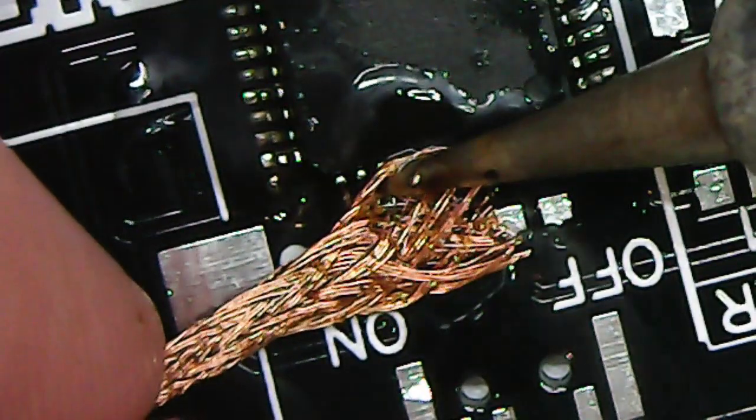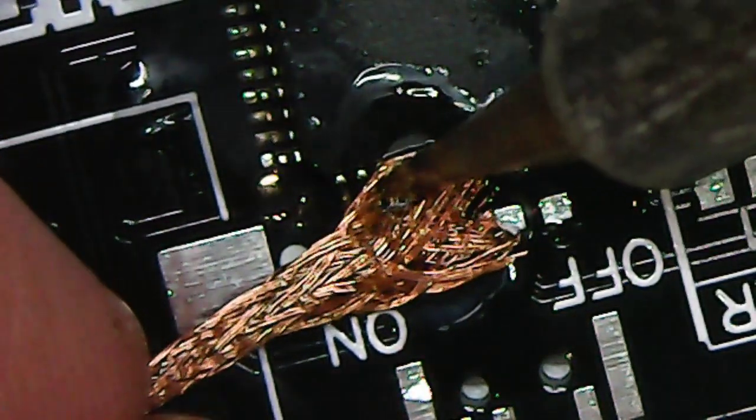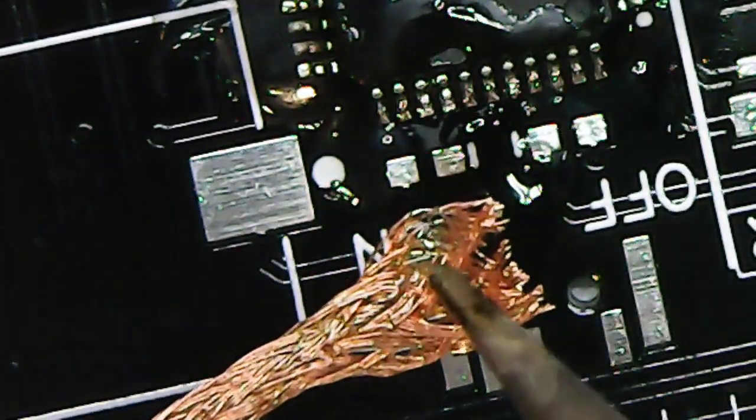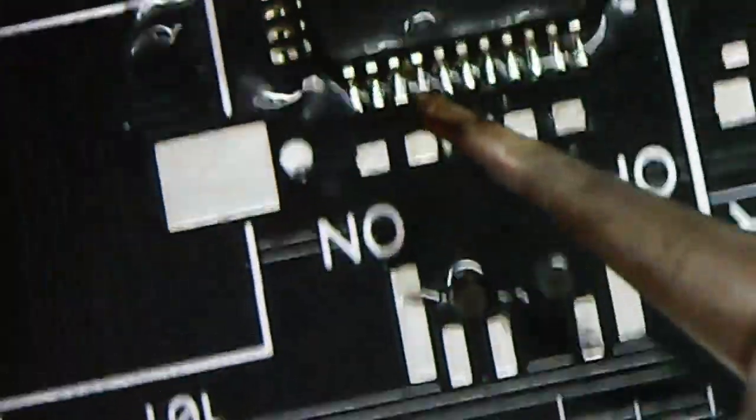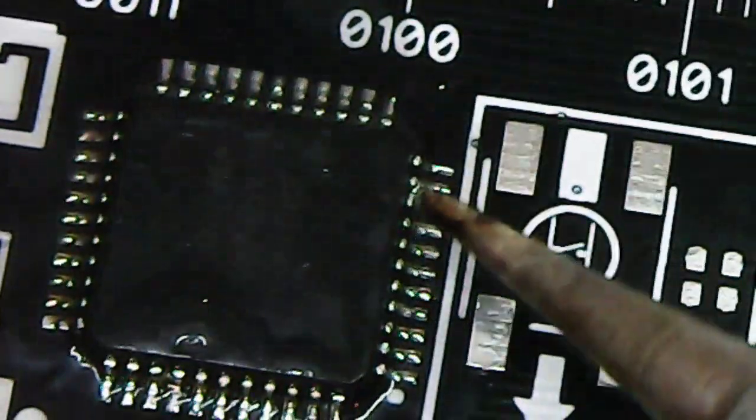The LED has two green dots on one end indicating the cathode. On the circuit board, the white line tells you which side the cathode should go to. If you put the LED in the wrong way, it's not going to work. So line up the green dots with the white line on the board. Get some flux, put a little solder on one pad, use tweezers to position the LED, reflow the solder, then flip the board and solder the other side to complete the connection. There's one LED with its 1K resistor just below it.